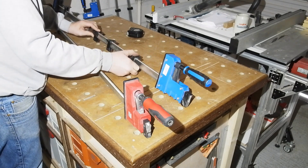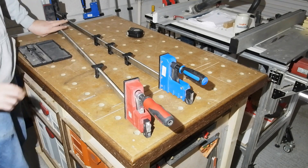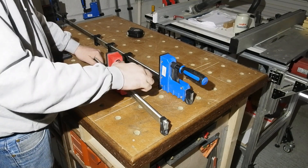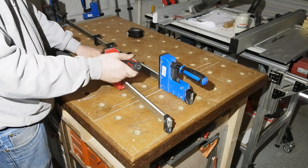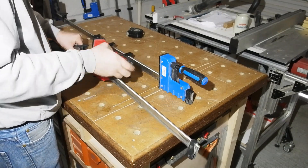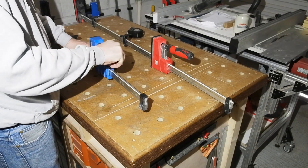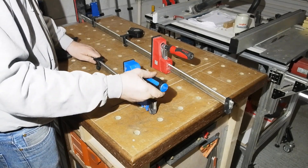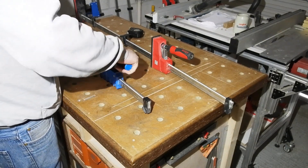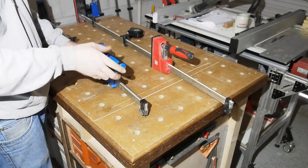The spacers from either clamp will fit the other, although the Bessie sit a little higher so they can't really be mixed and matched. The moving clamping jaw on the Revo feels very nice to use — the spring-loading element feels more engaged than the Salta's, which doesn't make a blind bit of difference to use but just feels better. On both, you lift the handle to move back. However, lifting the handle without pulling back caterpillars the jaw along. It's quite progressive on the Revo, making it a genuinely useful feature to creep up to the clamping point on your work. The Salta Body Clamp has the same functionality, just less so — the spring loading is there, just not as present. The caterpillar action is much less progressive, moving maybe a millimeter each lift of the handle compared to the Revo's ~3mm.